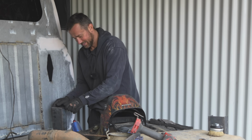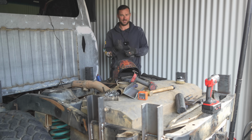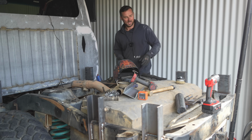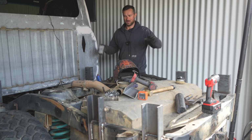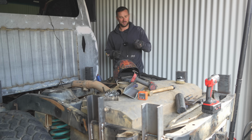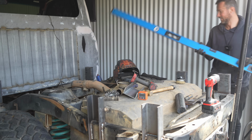Poof, I'm back. See, I got my little pieces now. Straight on top. Have all 6 of them. So now we're just going to go along, put them on. I'm going to get my straight edge or level, but it's used as a straight edge today. Once I put all these on, I'll run it from front to back just to make sure they're all the same height, because I know they can change. I'd prefer them to be perfectly the same height. If I have to, I'll space them up or down because they're all going to get welded on anyway.